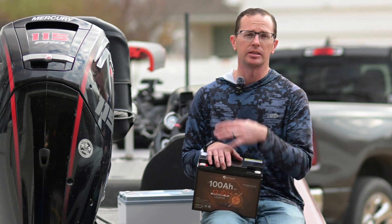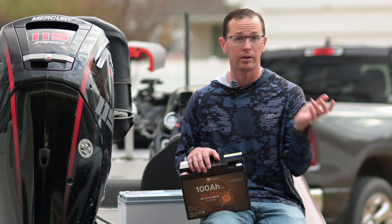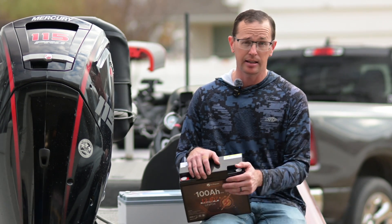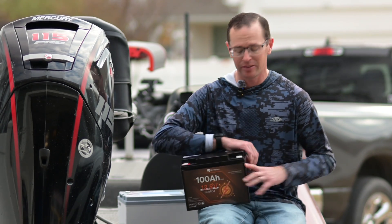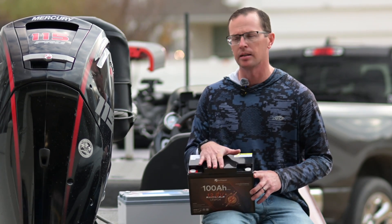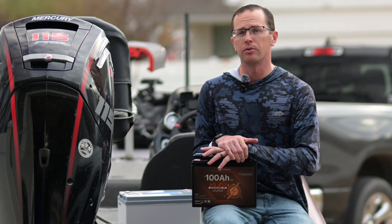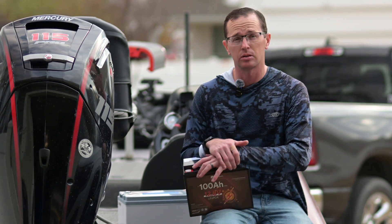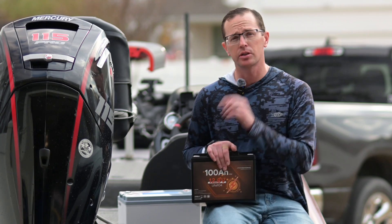Lithium iron phosphate chemistry is here to stay and is a cost-effective way to add energy storage to your boat, RV, solar setup, or any application. It offers excellent cycle life — thousands of cycles depending on depth of discharge. The battery management system includes low voltage, high voltage, low temp, high temp, overcurrent, and short circuit protections. This mini battery also has low temperature charge protection, which is important because charging a frozen lithium battery can cause lithium plating that permanently reduces lifetime and capacity.